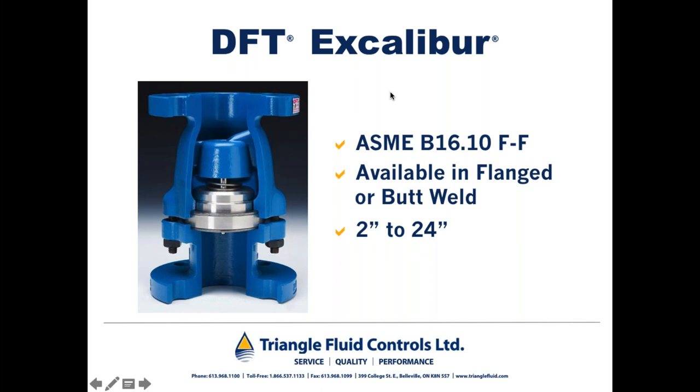Another typical application is on the discharge of lean amine booster pumps in a refinery, as an example. If they lose their lean amine, the hydrotreaters in a refinery go down, and if the hydrotreaters go down, the entire refinery will go down. So again, just a good illustration of how critical a service these check valves are applied on.